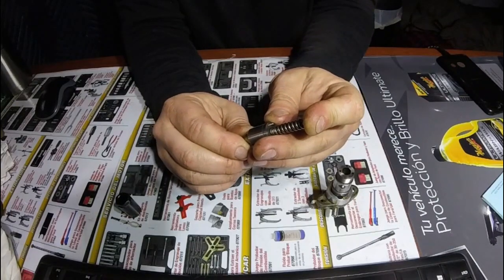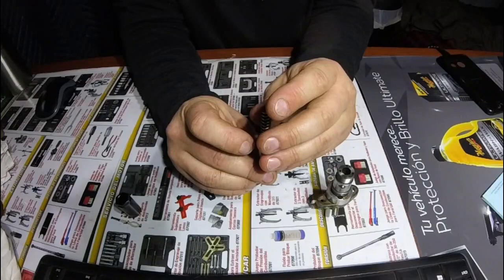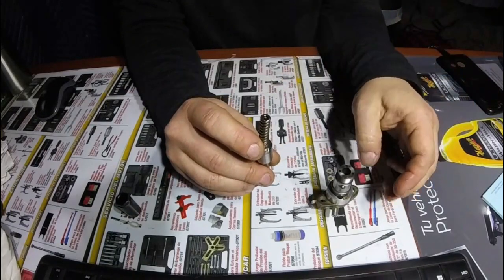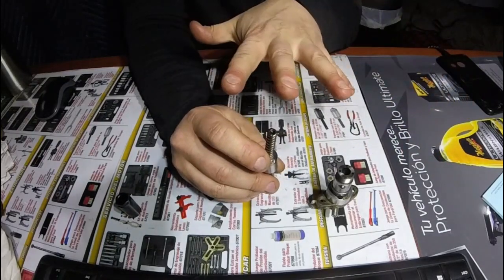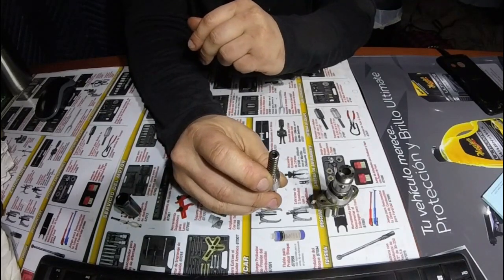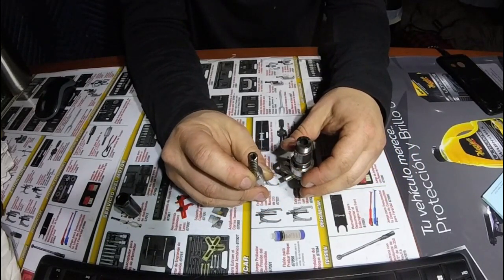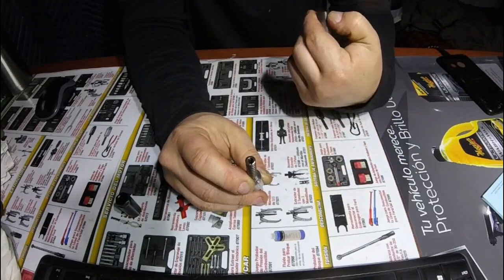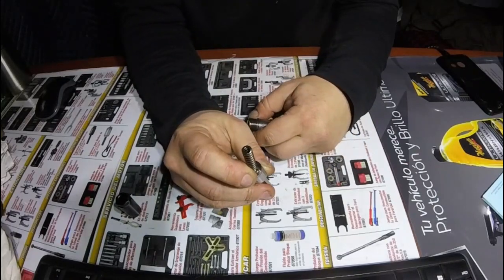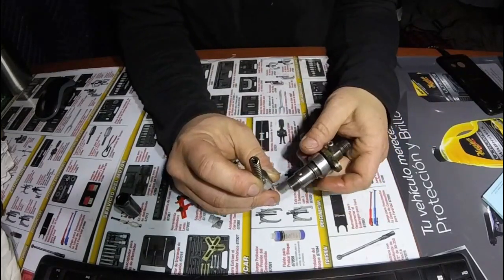It's pretty interesting how a poppet valve works, and this isn't the only type of injector to use it. There are some gasoline engines that have used poppet-style injectors. The GM Vortec used those — that was an electronically controlled poppet valve system. The spider legs on the 8-cylinders and the insect legs on the 6-cylinders — the ends of those are poppet valves that work a lot like these, though they operate at a much lower pressure, approximately a minimum of 55 psi, whereas this is 2842.